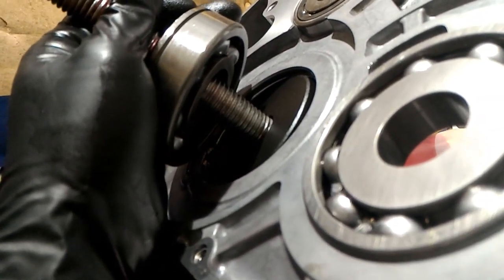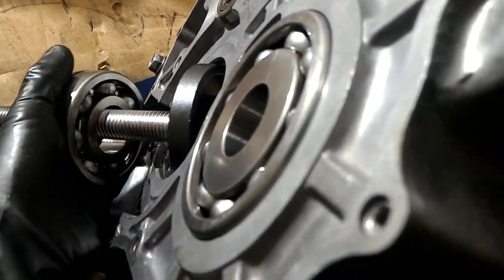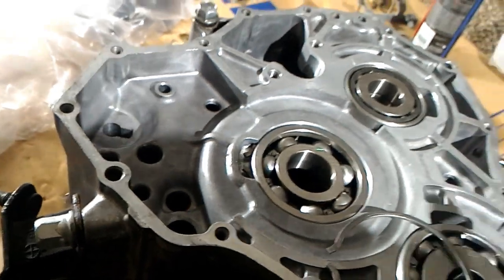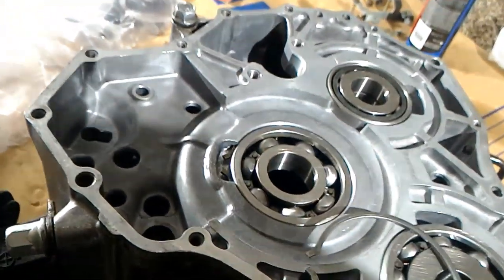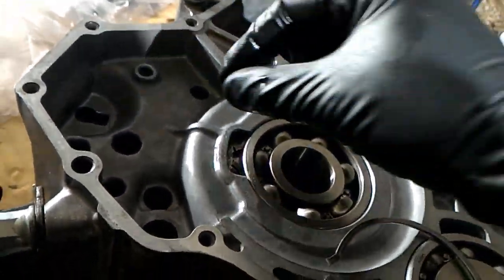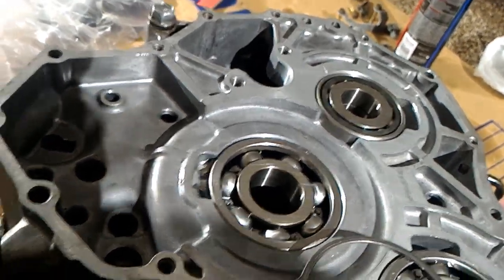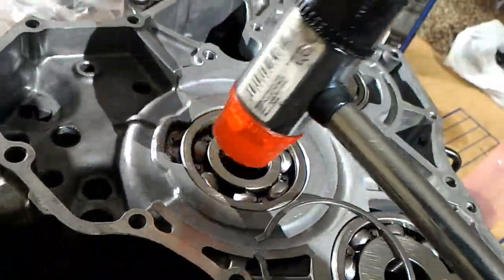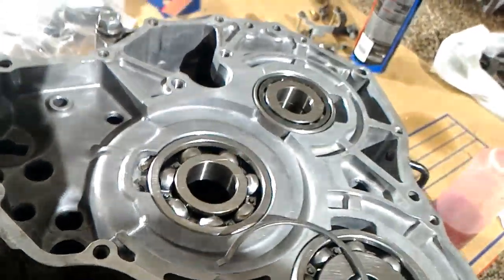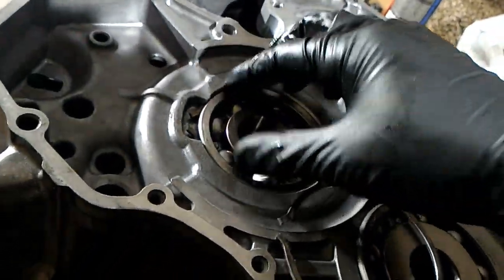The bearing is out after about 2 or 3 hours of trying to get it out. I forgot to hit record, but basically what I did was I spread these circlips out, then tapped this corner and that made the circlips bind and hold open. Once that happened, I kept holding them open, went around tapping it, and eventually the circlips just opened up and held in place because they were wedged. I kept doing this until it bottomed out and snapped into place.